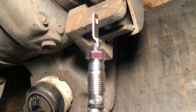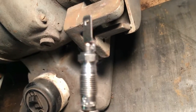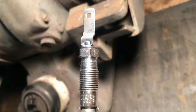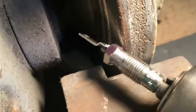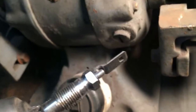See if I can jog it around to the scribe line — look at that, just about perfect. It's ground down, and it's ground down smaller than the threads, which is what we're going for. What I did was I held it at an angle on the wheel — don't make fun of my wheel, I haven't changed it since my grandpa was my age, this is an ancestral grinder. I held it at an angle and ran it across until it ground down — pretty simple. Just make sure you got it tight but not clamped down on the tip.